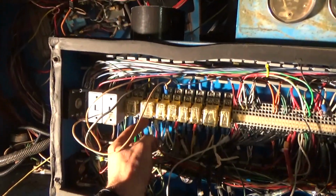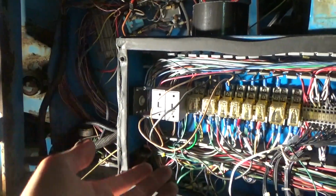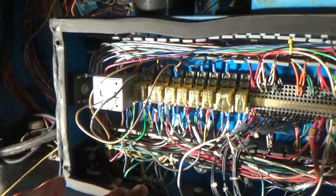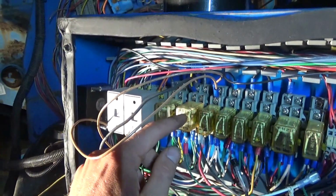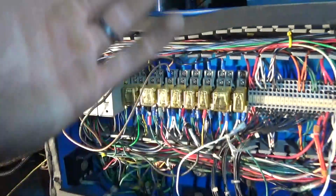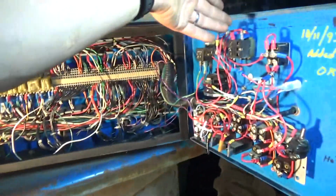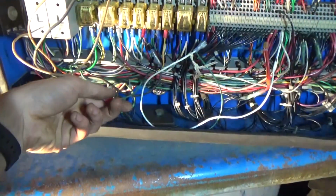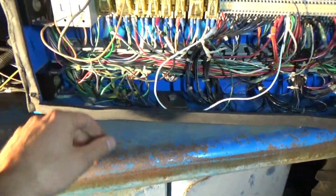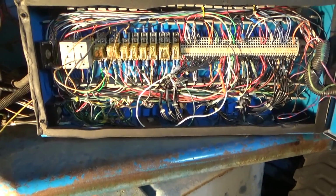So this relay would permanently be energized, right? And you know what would happen then? If you get a feed, it'll click down. So it would do the same thing. It would kind of start, right, and then stall out. Yep. Same thing as having no oil pressure. Yep. It's like a safety. So, good thing we disconnected this here, so we don't need to worry about undoing that twisty tie. All right. Yeah, just to complete the story.